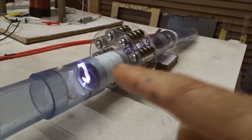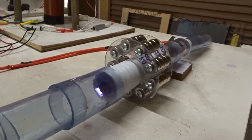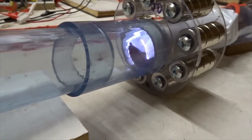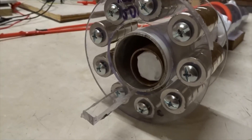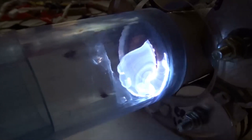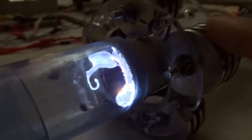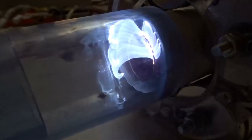When we place a stack of permanent magnets inside the copper electrode, in line with the ring magnets about the same length, far from the end we just get slow spin like before. When fairly close to the end, we get tremendous spin and ejection. However, it becomes unstable because the magnets inside don't want to stay in the center — they want to go off to one side of the ring. This could easily be an ion rocket: five sets of magnets arranged in a ring with aluminum and copper tubes between them, the argon ions both spinning and ejecting in a fairly versatile fashion.